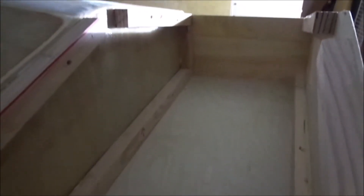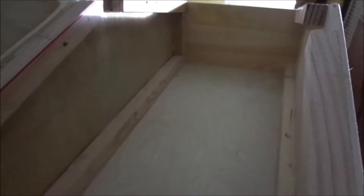So this is the progress on the trim tabs. I have the basic pieces screwed together in a temporary arrangement. After I've completed the bottom — which is this part, because everything's upside down — I'll check the fit, then epoxy it on with an epoxy glue solution, and then sand it and it'll be ready for glassing.